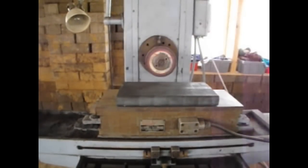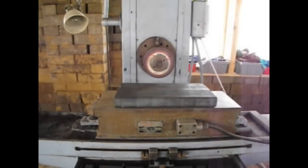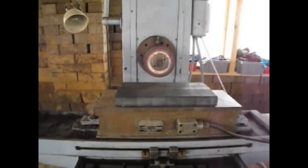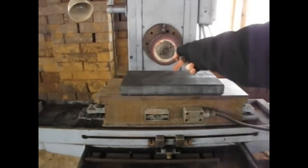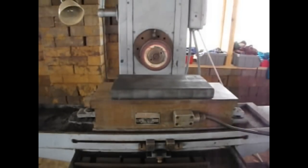Using those movements, we can turn on the grinding wheel rotation and it'll start spinning. Then what we do is move the grinding wheel down with that upper hand wheel onto the top surface of this iron block we have here, and we grind off the top surface.